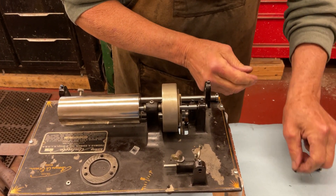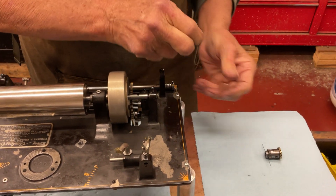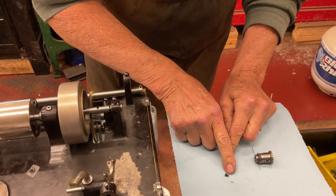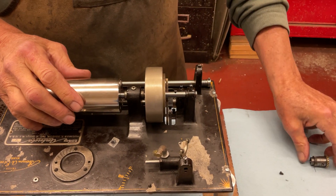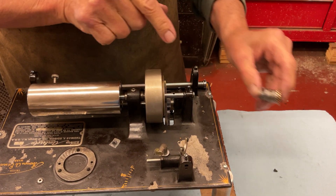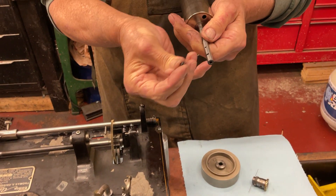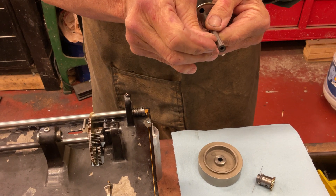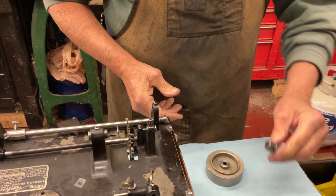In the videos about rebuilding it, I said we have a super special screw. This super little special screw, which you do not want to lose, goes in here. The end of that thing runs right in this little piece here. So when you put it all together and you know that this hole is aligned up with that little piece, you want to put a little bit of sewing machine oil in here, because over time this little nipple thing on the end of that screw is going to hit this slot and it's going to be moving back and forth like this. You want it lubricated, and that will help it not break the wire.